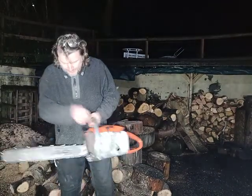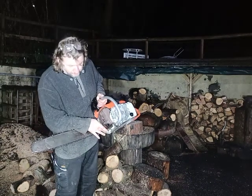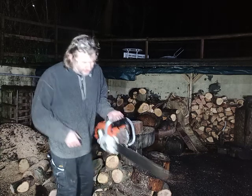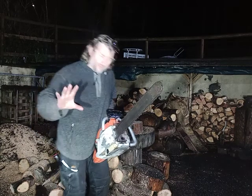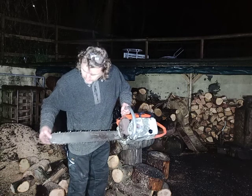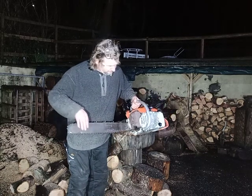Has a little bit of damage here on the inside. So, depending on whether you really would want to put on an inside felling spike, you still have the facility to put on the outside or external felling spike. Clutch looks incredibly clean. Chain feels sharp. The guide bar has a little bit of pitting at the nose wheel end.